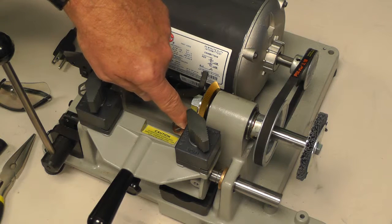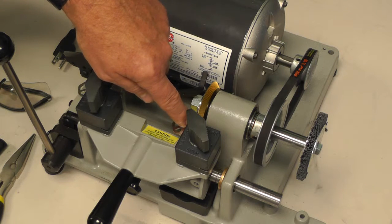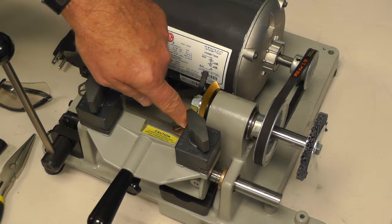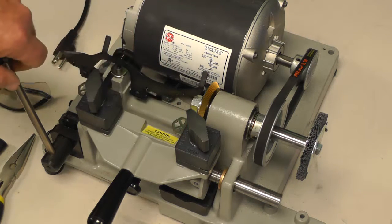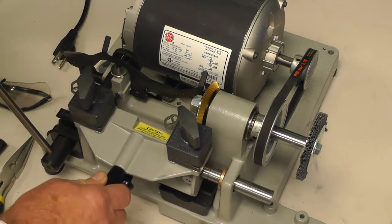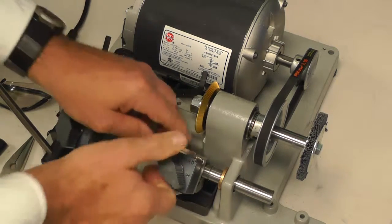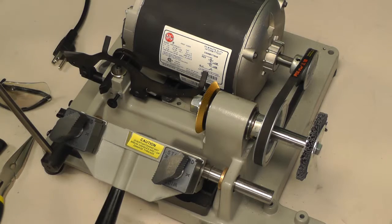So if you're able to get two sheets of paper in there nice and firmly — and like I said, one sheet of paper minimum — your adjustment is complete. It is something to check periodically and make sure everything is working right by throwing a couple of blanks in when you get a chance, and making sure you're adjusted properly. After that is done, just push down on your carriage, remove your keys, and you are complete with the spacing, or what they call the side-to-side adjustment.